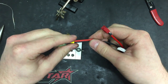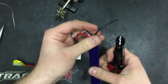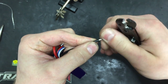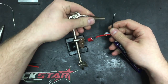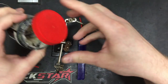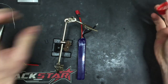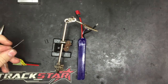Now moving on to our second connector - time to cut the wire, so we'll just line them up, cut the wire, and strip about four millimeters on the end. Shove the insulation up and twist as you pull it off - that keeps the strands together. Again, you can see the wire pointing slightly up, and that's going to let gravity help the solder join as well. A bit of flux over the top there.